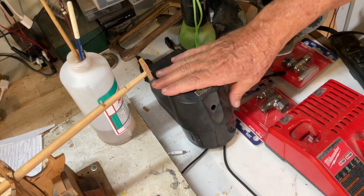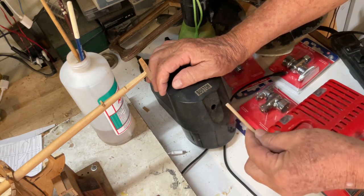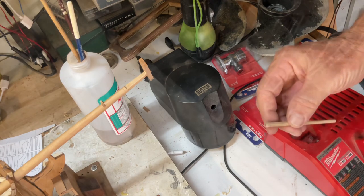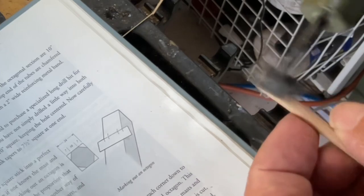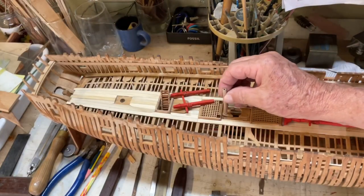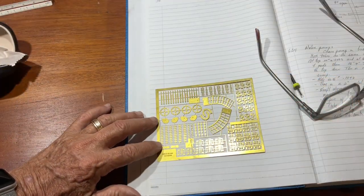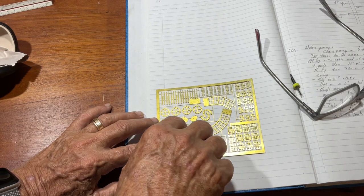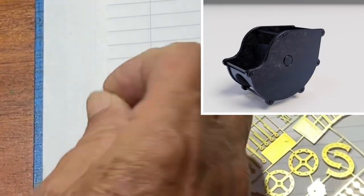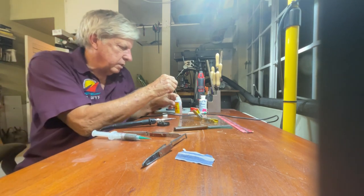Here's a little trick: we have a pencil sharpener — manual or electric — and I've marked out what I want to cut, push it inside. This really just gives me the starter, which is all I want, and now I'll finish it up with the pen sander. She's perfectly in place. I had purchased this photo-etched plate from Admiralty Models, so I'm just going to cut out these two sides of the pump intake chamber which we're going to make up now. We're going to put the first set of solder on it, so the first thing we're going to do is apply a little flux cleaner. I have cleaned it with isopropyl alcohol already.